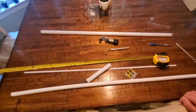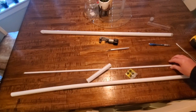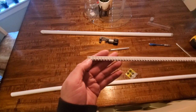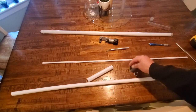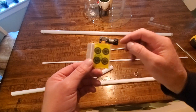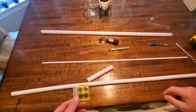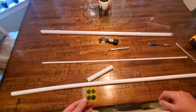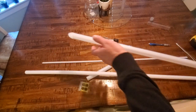So that's what we're going to go to next, the Neopixels. And we'll see you back up at the soldering bench, where we don't have to cut these. All we need to do is tin these pads, solder our wires to it, and then add the resistor onto our blade target. Then we're going to solder our wires from the pixel stick onto our blade target, and we're going to be ready to do the final assembly on this blade. It's just that easy.